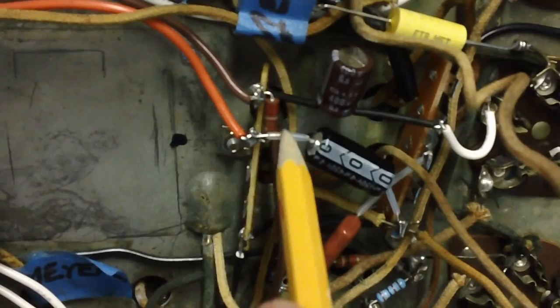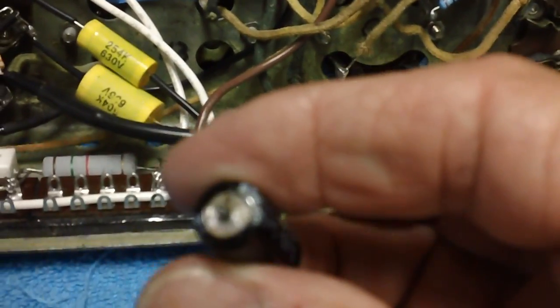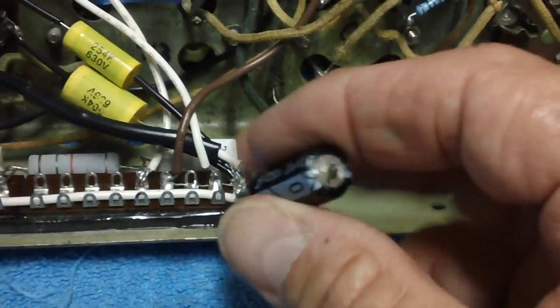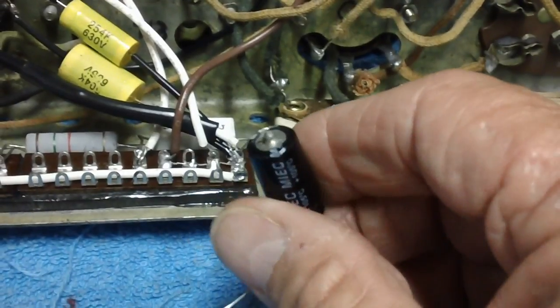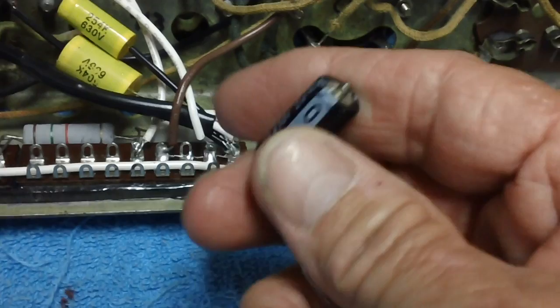She's in. This time I was able to pull it off without breaking off that negative lead. You know, I tried to solder that lead back on there, but that was a total waste of time. Apparently, the casing on these capacitors, they're aluminum. You're not going to solder it to aluminum, and it's just not enough in that little end of that little point there to get a solder to stick. Besides, it heats up the capacitor pretty hot.